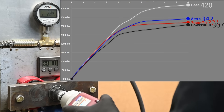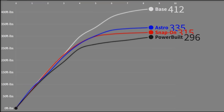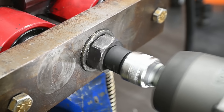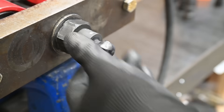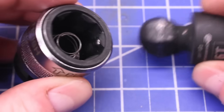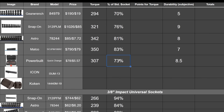307 foot-pounds — better than expected. Gear Wrench X-Core remains the lowest so far; this is now second lowest to date, but for a two-piece design, we expected even worse. What we expected to be worse for sure was durability testing — on each socket we use an increasingly tortuous lineup of air and cordless impact wrenches to try to break or seize them, impacting at each angle and straight on. To our amazement, this one's not phased. Initially gave this greasy-looking hex ball an 8 out of 10 for wear, but cleaned off it's bumped up to 8.5 — still looks remarkably good with some smoothing and flattening at worst. Overall: 73% for torque transfer, 8.5 out of 10 for wear. Better design than I figured.